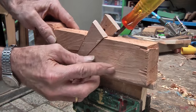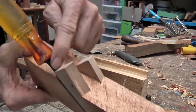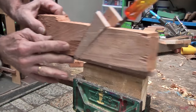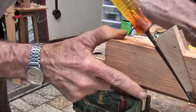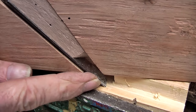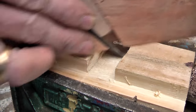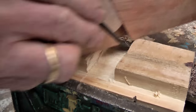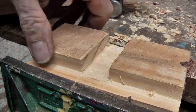If your grain is going this way that's fine, but if you want to go the other way just turn it over and make another one for the other side. So you can go down that way or that way depending on which way the grain is going. At a pinch you can also use it as a router — lower your knife to the depth you want and then check that your groove, cleaned out with a chisel, is now to the level it's supposed to be. And there we have it.